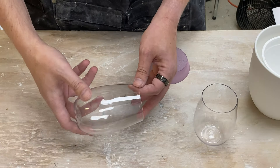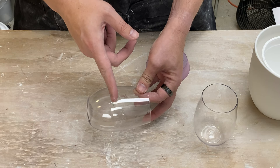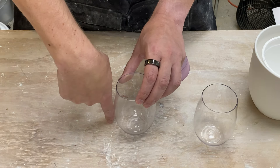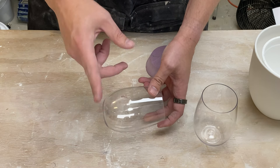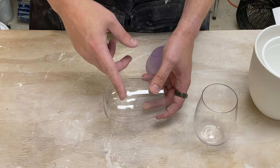All right, that was a whole bunch of explanation. Here's another one of those cups — I went ahead and marked the part that sticks out the most using a square to find that area. The problem is if we're off a little bit to one side or the other, we'll create an undercut, so we need to nail that middle area as well as possible.